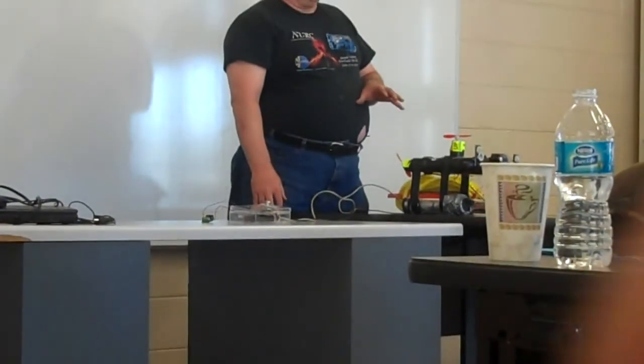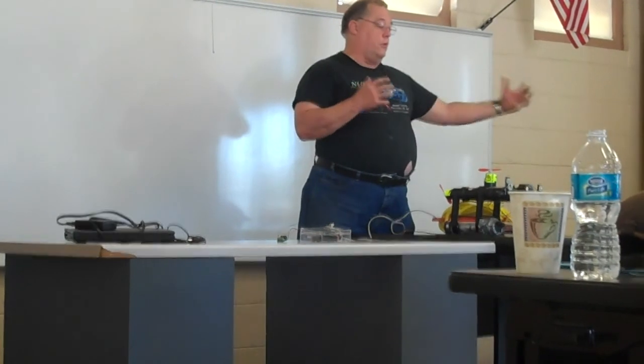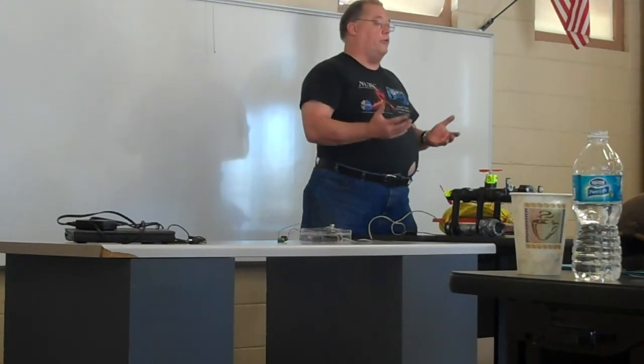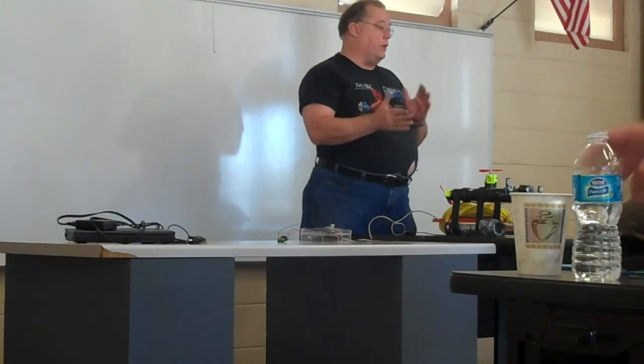That also is not quite yet done because I've been having trouble with my communications protocol. Last year, when I finally got last year's robot in the water, it worked up until the point that the communications went down. And the problem was that I was using that same 20 milliamp 0 to 5 volt CMOS to CMOS communication link from the bottom of the pool all the way to the top. And once it goes into the water, even 5 volts hydrolyzes water. And the varying rate of bubbles caused a little bit of static. And with such low-level signals, that swamped the actual communication. I lost contact and it just floated. So this year I'm using a 485 bidirectional driver, which is much more robust, much more noise resistant. And hopefully I'll be able to take care of the problem, but I've yet to get into the pool to test that.